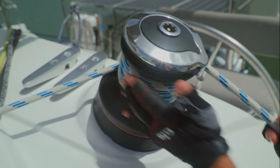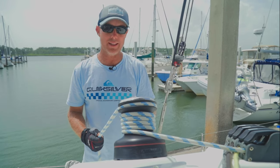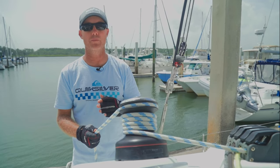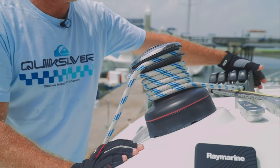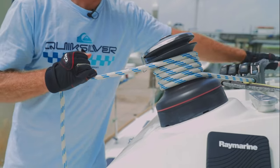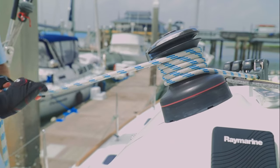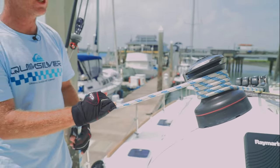Another really cool trick — when you're tacking, here's a way to get the line off the winch really quickly, and it keeps your hands far away from the winch. First, make sure your rope clutch is closed — that's holding all the load just for safety. Now go ahead and take the load. I've got all of the load, so I'm going to open the rope clutch. With this loaded line, I'm going to keep my hands fairly far back and flip loops off of the winch.